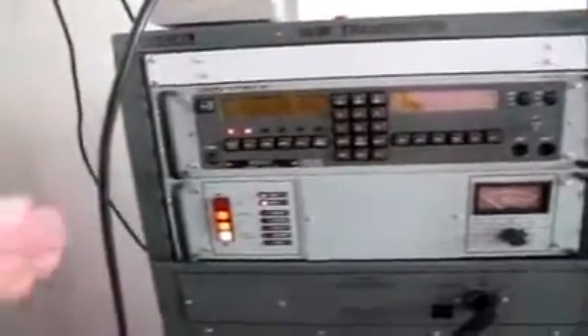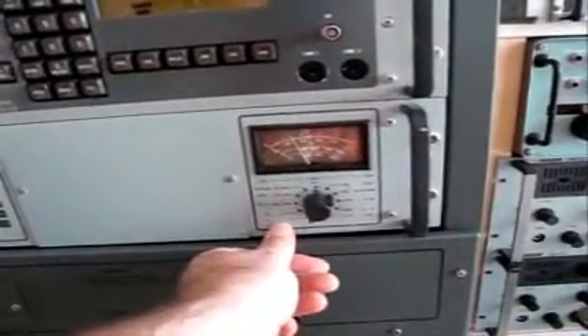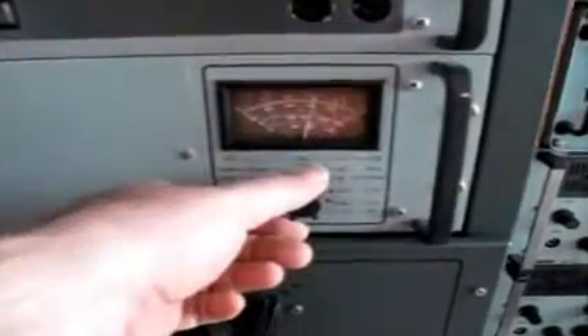So the transmitter is now warmed up. The tube is heated for 2 to 3 minutes and now the EHT is applied. We can have a quick look at some of the scales here: the 1 amp tube current, 200mA, and EHT at 3kV. So that's all there right now.